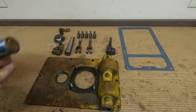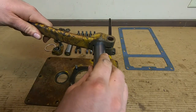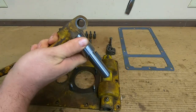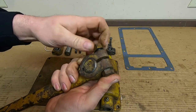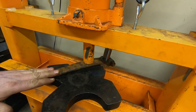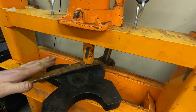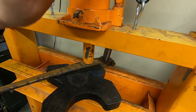Before I put these shafts back in, I want to use one for a tool. I think it's time to try and straighten the steering clutch lever, and I want to throw a shaft in that bore right there to kind of give it some support. Alright, I just did this off camera — and it went just smooth like that. We'll get that wedge out of there and cinch this down. Now I'm going to try a cold bend here. We're supported there and there, and I'm pretty much centered up on the bend right now. 50-50 odds this might break, it might straighten. I'd be disappointed if it broke because I like to keep it matching with the rest, but if it does, I have more. We'll just start throwing some pressure on it and see what happens.